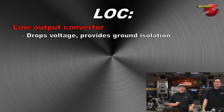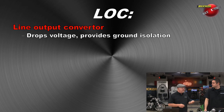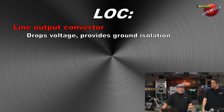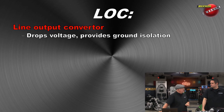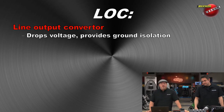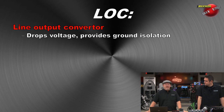The speaker output of any radio takes two wires — a plus and a minus — but those are only there for reference. There's no always-positive or always-negative voltage; it changes back and forth. That's just a reference so you can get correct polarity between left, right, front, and rear. The speaker wire coming out of a head unit cannot be shorted to chassis ground — whether it's factory, aftermarket, or out of any amplifier. If you short it to ground, you're either going to damage the unit or it's going to go into protection.